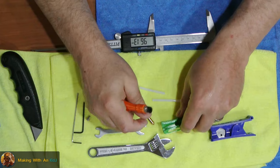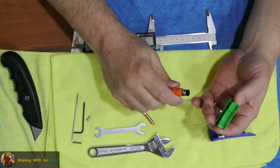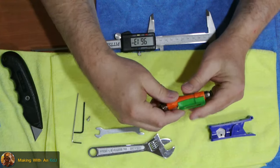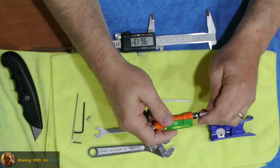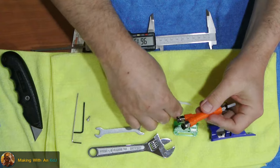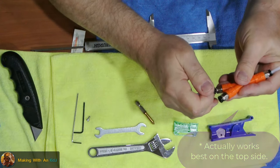The way this installs is we put it on the back of the printer with an M3 by 6 socket head screw going through this slot into a screw hole — we remove the existing screw from the back panel to mount this. It just snaps in with a nice positive click and is held in place with the clip. We insert the short piece of PTFE tube into the single bottom side of the Y and push it all the way until it bottoms out, then the longer piece goes into the other port.